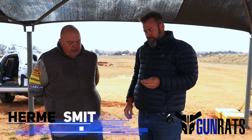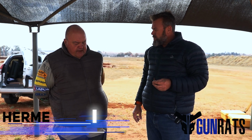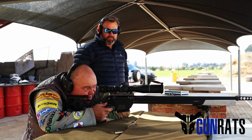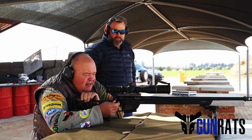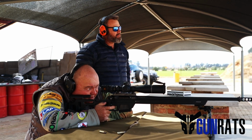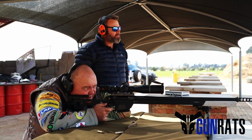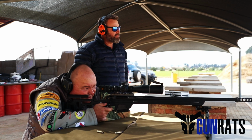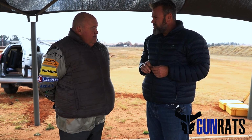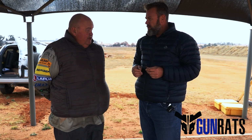So what we started with, we load a few rounds, not high, not low pressure rounds. Okay. And we brought it to the range and we break in the barrel properly. So how many shots would you take, give or take, for that? The way we break in barrels, it usually takes about 7 to 10 shots, but we shoot one shot, clean it properly, give it a good clean. If we look at the barrel, sometimes we polish it a bit after each shot, and then by shot 7, 8, you'll see that the copper fouling basically starts to disappear when you clean. So then you know the barrel is nice and smooth, and you can start to shoot it.